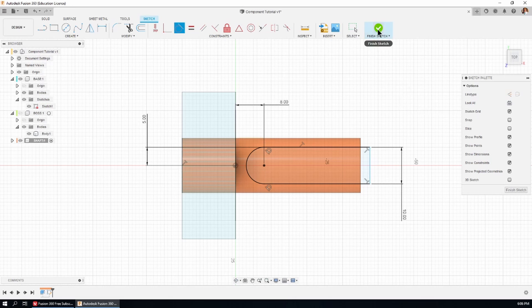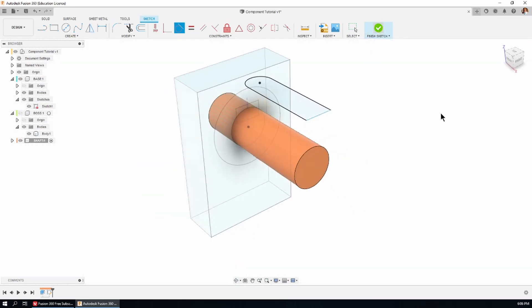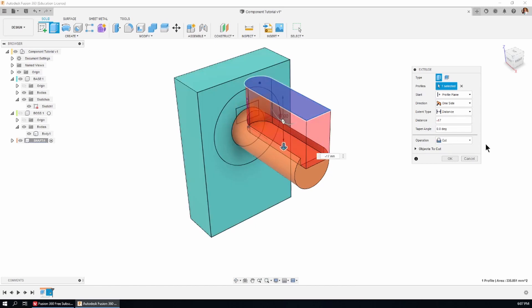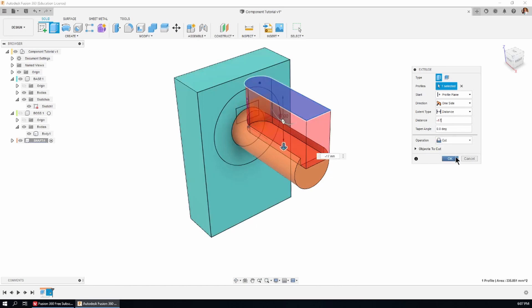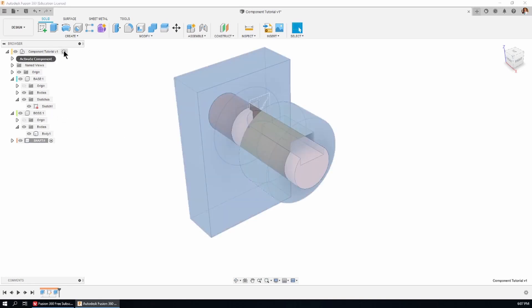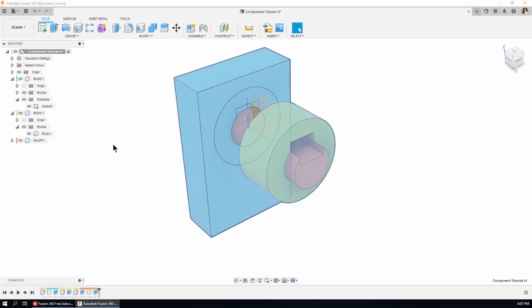Finish the sketch. I want this to be a cut going in a downward direction. It's 20 millimeters from the top of the base to the center of the shaft, so I want this to go down 17 millimeters. Hit E, select the profile, go in a negative direction to minus 17, it's a cut — okay. Let's turn on the visibility of the boss again, make the top of the tree active, and now we have our keyway.